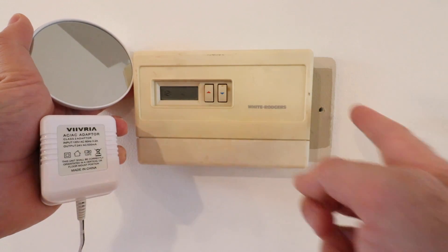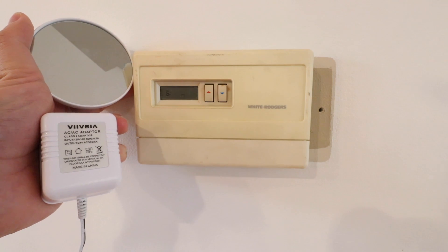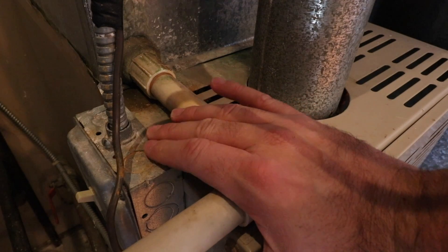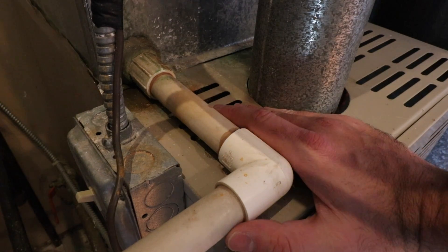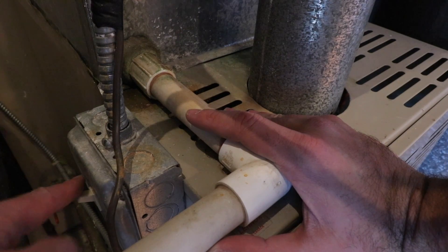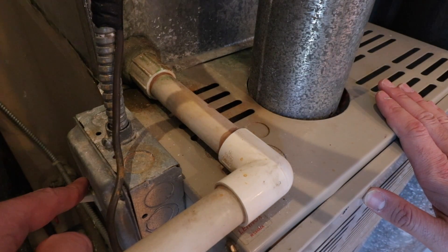The first thing we need to do is turn the power off to our existing HVAC system. Turn the thermostat up to heating so you can hear the system kick on, then go over to the HVAC system itself and turn it off. On our HVAC system we have an on/off switch directly on the unit. Make sure your HVAC system is on so it's heating or cooling and blowing air, so you can confirm that the switch controls this system when you flip it off and no longer hear any noise from the unit.